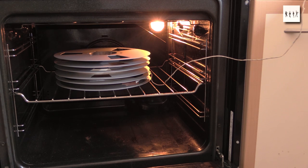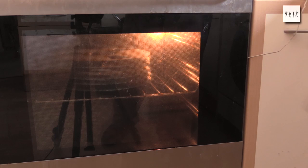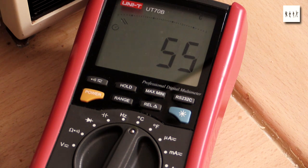Now this may seem a little crude but there's very little alternative. I've got a thermocouple cable going to a sensor buried within the tapes. The controls on the oven are very crude, not calibrated properly at all, so use an external temperature meter and wait until it gets up to about 55 to 60 degrees C. I give it about four hours and that seems to do the job.